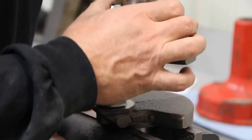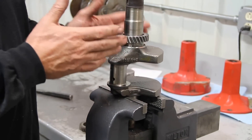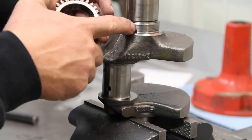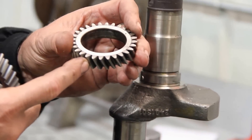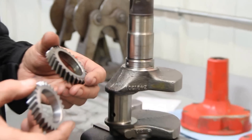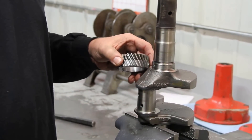When you get it done, you'll have a timing mark right in the bottom. The dowel pin's going to drive the gear, and this gear is made out of 4140 hardened steel, so it ain't going to break like the powdered metal stock gear. You can even do this with a stock gear — just drill a spot right between the parting line of the crank and the gear and put a set screw in there. But the trouble is you've still got a powdered metal gear that can break, and when it breaks the camshaft falls, you'll bend all your valves and your motor. So it's really good to put a quality crank gear in. It's easy to do at home without special tools — just a 3/16-inch drill and a torch, and you can put it on with a little persuasion.